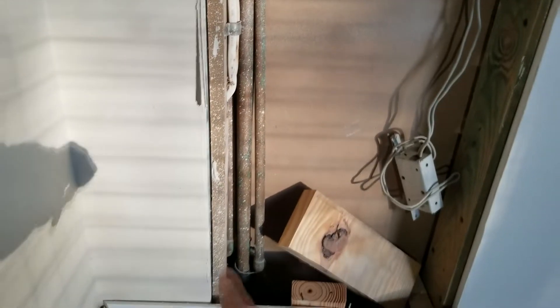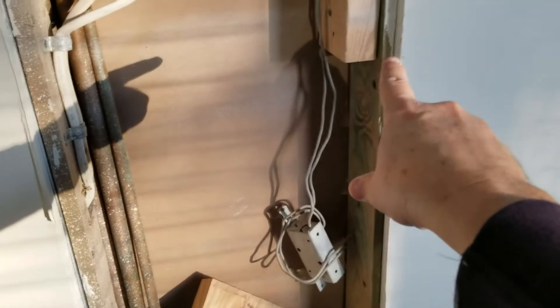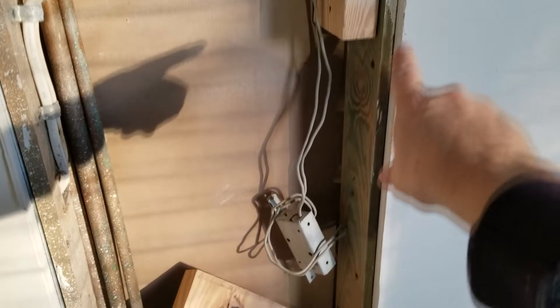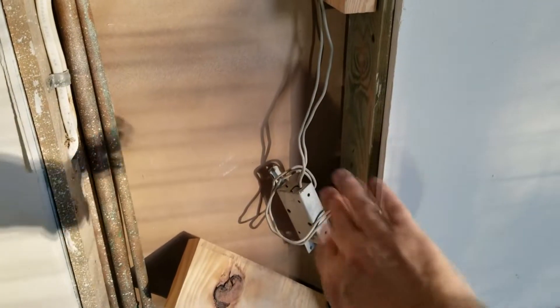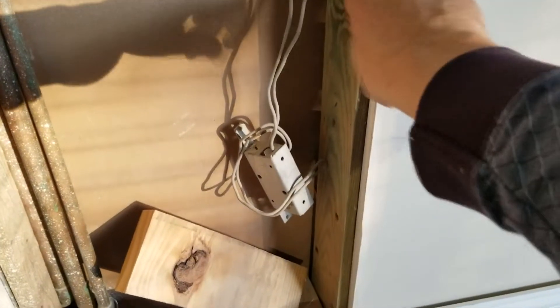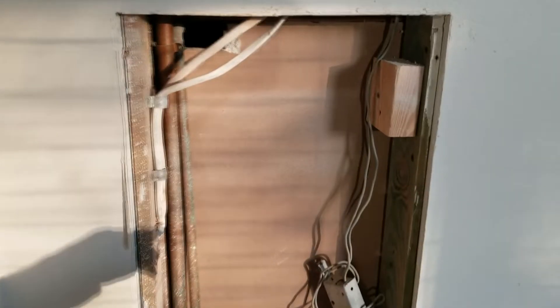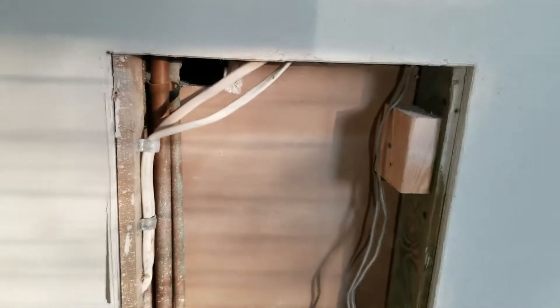You can see they have a metal stud right here that the drywall is screwed into, and then the builders' electricians originally came in and put this piece of wood in so we can use this on the left hand side to screw our drywall piece into. And likewise on the right hand side there's another metal stud inside the drywall, and I put a 2x4 in right here — screwed in up against the stud in there — so now we have the left side and the right side to anchor our drywall piece to. All we need now is something on the top, and I always do it for completeness.